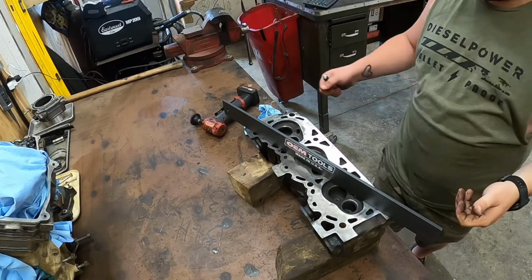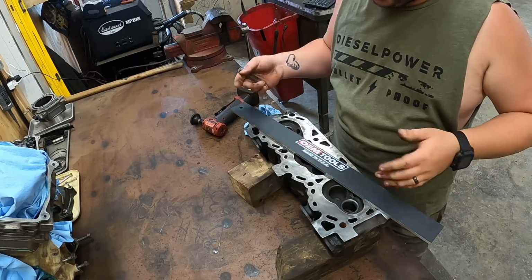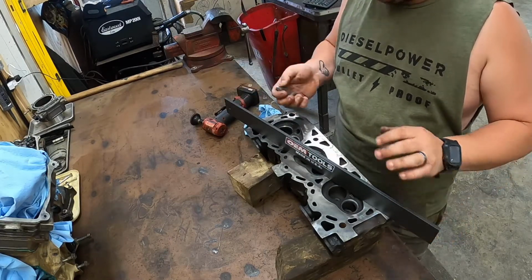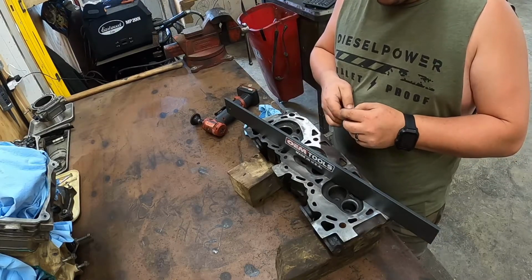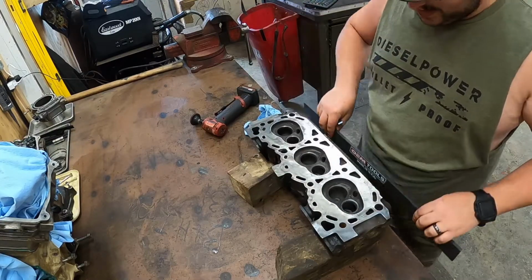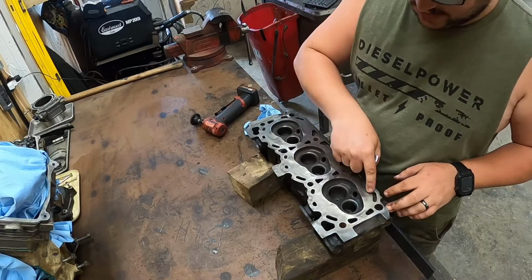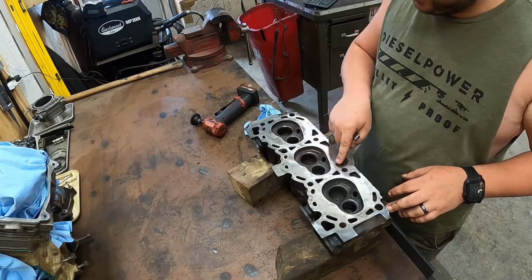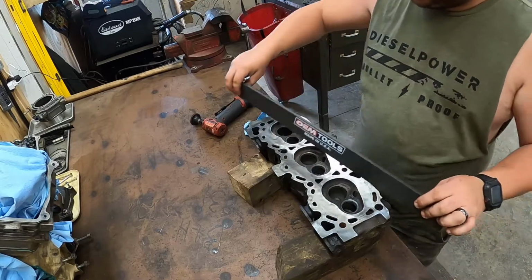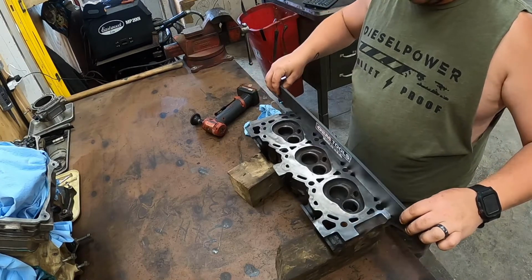Alright. So, just get you a straight edge. This one's made for heads. It's just an OEM tool. You can get it off Amazon or eBay. So, what you do is you want to check around here where your seal is on your rings or your head. So I can faintly see the old lines just from where they kind of ended. They didn't end at the end of the metal, but I can see. So I always check like this.